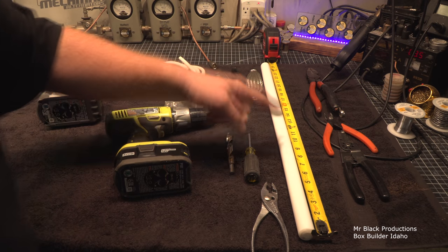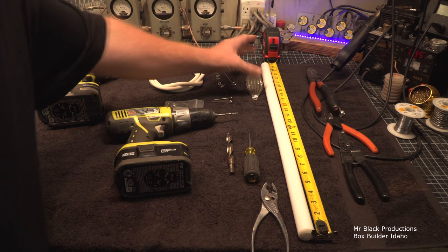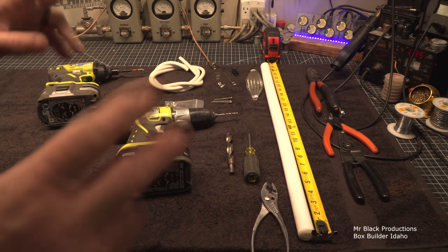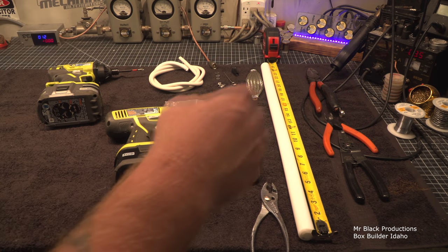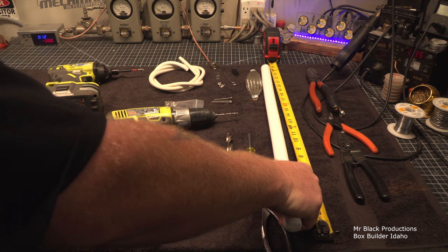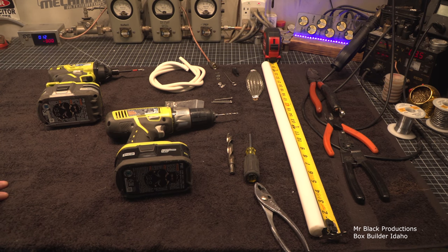You have the electrons go from here to come back to here. I like to work with a safety factor of at least 10. So if the book says that, depending on the moisture grains in the air at the time, your elevation and your dust content in the atmosphere, for X amount of volts we're going to present X amount of inches worth of insulation, I want to have 10 times that before I grab about 4.5 inches, maybe 5 inches worth of this bar, and intentionally expose myself to becoming a conductor. It's no joke.